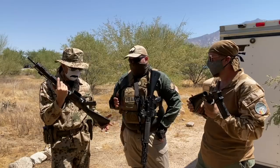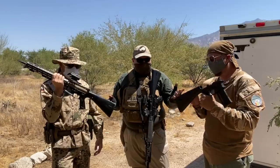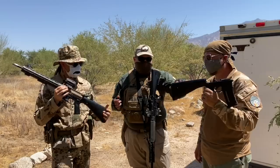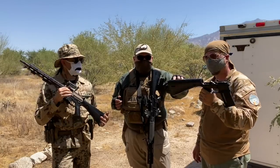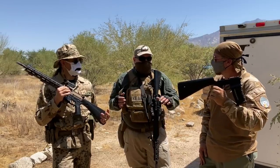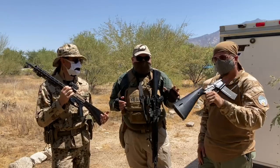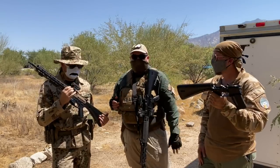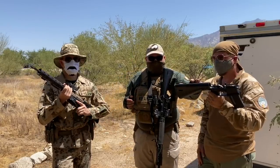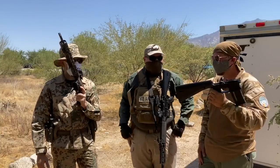So other than the PDQ lever, the lower is pretty close to how it will be sold, other than one of the things we have to do for production is texturing is going to be added. A lot of people have been seeing, oh, they're shiny. Is it going to look like that? No, the machine marks and the shine are going to be taken off. Now that we know what we need to do to correct any of the issues in the mold, adding the finish is like the last thing you do, because if you have to correct anything, then you've got to go and refinish it yet again. Right. So it'll minimize the appearance of the ribbing lines from sink on the outside, and it'll get rid of all those tooling path marks and stuff you see on these ones currently.